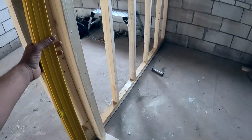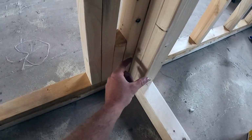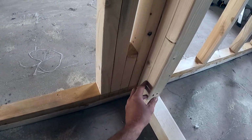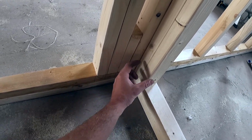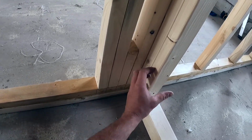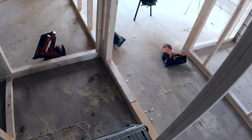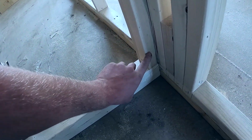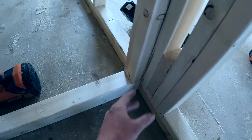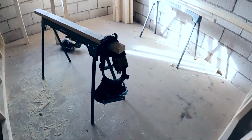And wherever possible, leave plenty of room for the nibs on the doorways. That's so when we do the second fix, your frame will go here, and then you won't have to rip the architrave down. So try and create big nibs everywhere, if the drawing allows it. Like here, for example, you can only fit one leg in there, so that'd be a bit tight, but we should just get away without ripping it. But always try and leave big reveals, just to make life easier later on.